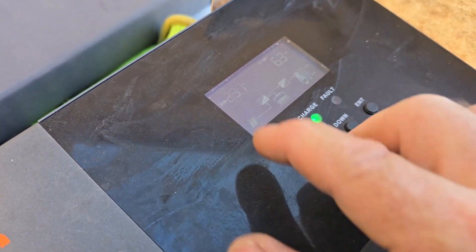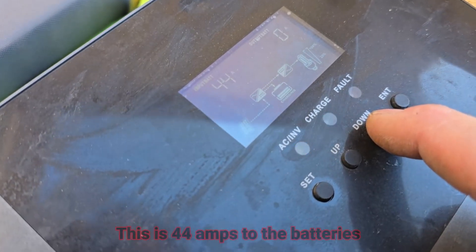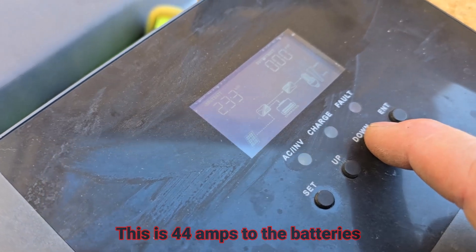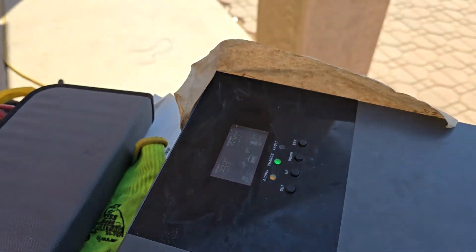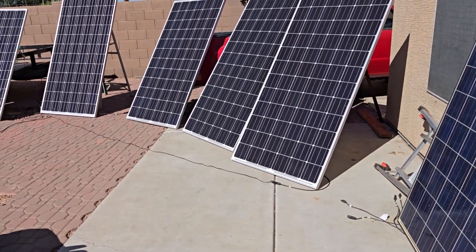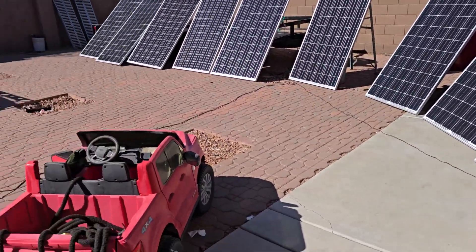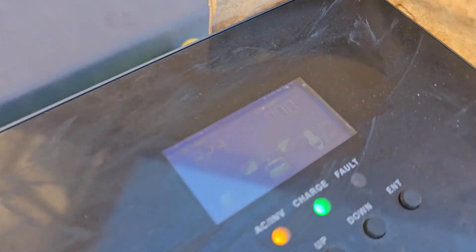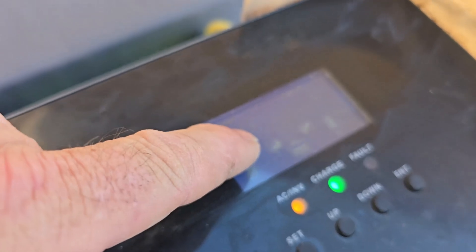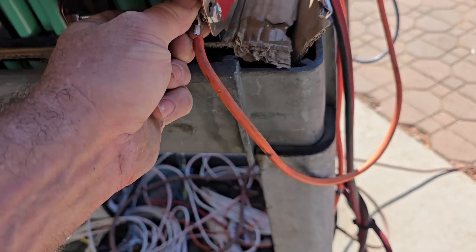It's settling at 43 to 44 amps — putting 44 amps into my battery, 2.3 kilowatts. That added another kilowatt when I put in the next four, making nine total. So I've got 2.3 kilowatts going in there right now, which is 43 amps at the 48-volt level. It's putting 48 amps — if I don't tighten this connection, it might get hot.